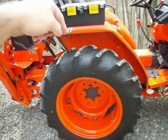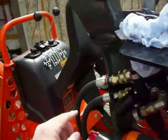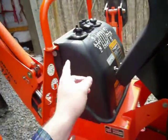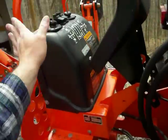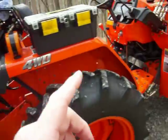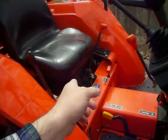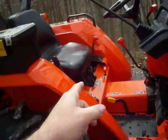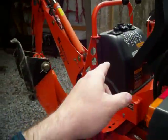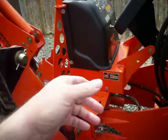My hydraulics go to here and then two lines go to the backhoe. If there's any problem with any one of those valves, it's going to cause problems. It's also the last one in the chain and it collects the most garbage in the system. There's a strainer on this backhoe, but that doesn't mean it catches everything.